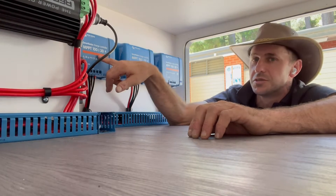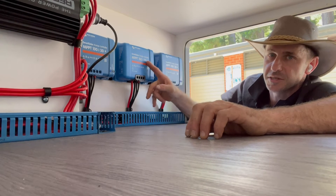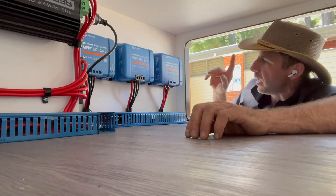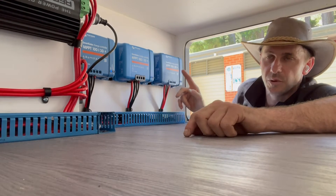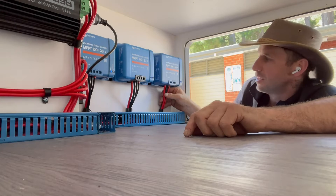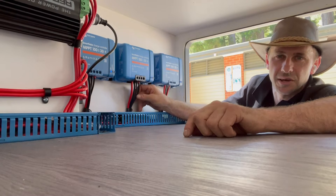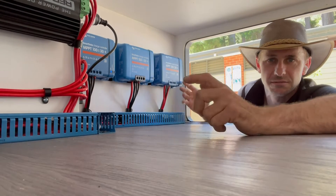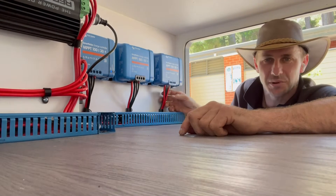Two panels in series on the first 400-watt setup — a 40-volt open circuit. Three in series on the 600-watt setup with three 200-watt panels — 62-volt open circuit. And the other 400-watt setup is two in series, two in parallel, giving about 42-volt VOC. So big cable runs, but the load on those lines doesn't exceed what one panel can do. The load on the four 100-watt panels is about 9 amps — I'm only transferring 9 amps from the roof all the way down here. The 600-watt controller carries 9 to 10 amps over the same distance, yet produces around 45 amps output.